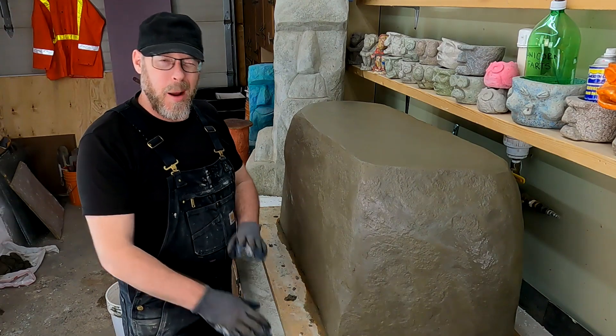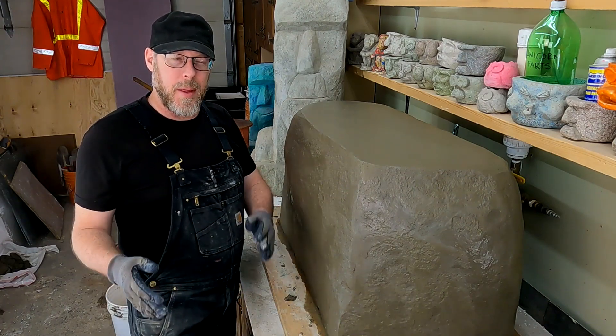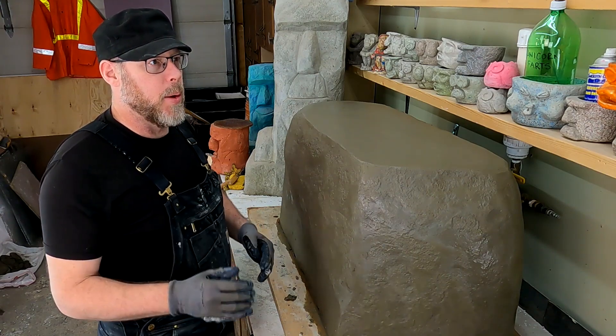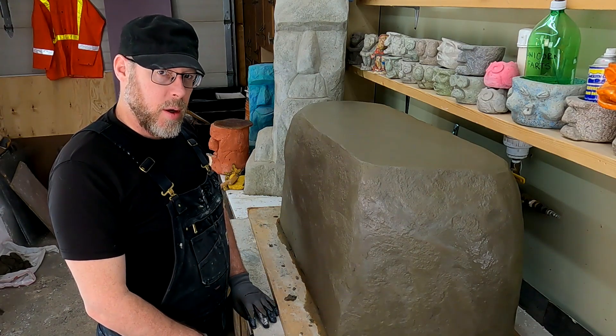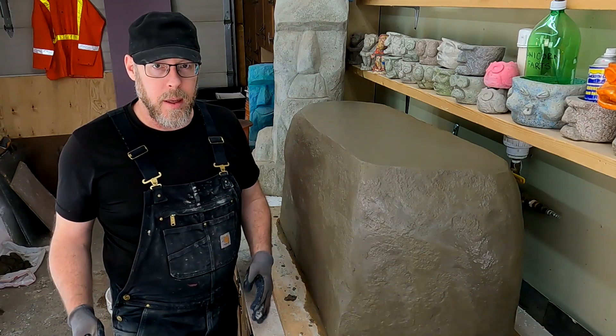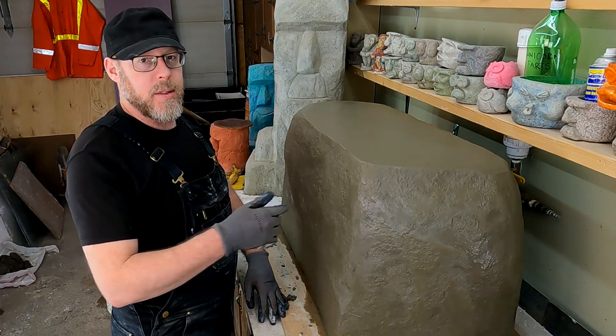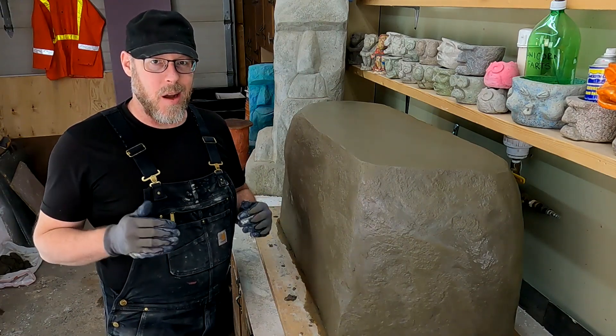Put your driveway underwater — you can water it. Is that the same thing? It's not the same question, but the answer is the same. In both instances, it's actually really good for the concrete. In theory, concrete that is cured underwater not only is okay, this is optimal.